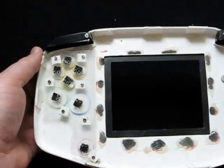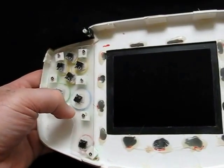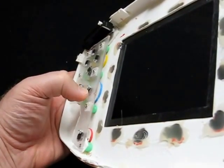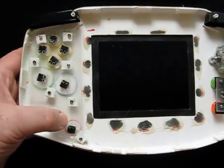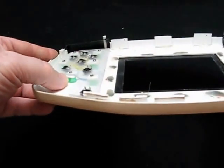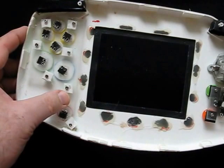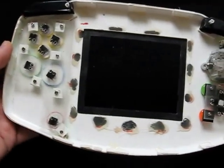In the example where I made the buttons myself and used rubber-top tack switches, the back plate is very slightly bigger than the button — and this illustrates what happens when it's pressed. The rubber-top tack switch provides the feedback: when pressed, it makes contact; when released, the rubber pushes the button back. A piece of clear Perspex was made to fit and held in position by plastic beads. This is then ideally screwed together so it sticks down to the case, and if you ever need to do repairs, you can undo a few screws and get into the system easily to change buttons or anything else needing repair.